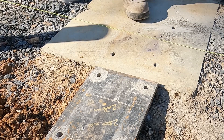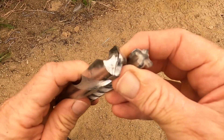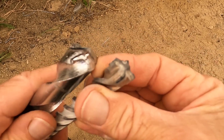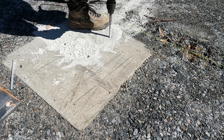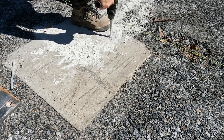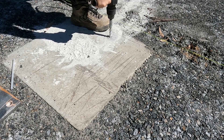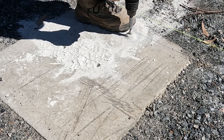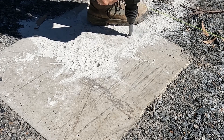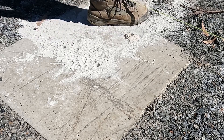There's the anchor — you just rotate them in as you go. On the left there's a standard drill bit and on the right is the one I'm using. You can see the cross piece versus just the single carbide. The main advantage is if you're unfortunate enough to hit the rebar — which I do here — that higher quality drill will actually drill right through the rebar. You slow your drill down and it starts to wobble a bit as it eats through the rebar, then goes through and you can continue on. With a standard drill you're going to have all sorts of problems, so it's worth the extra money for a good drill bit.